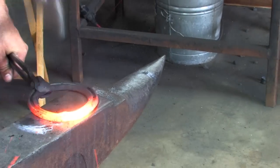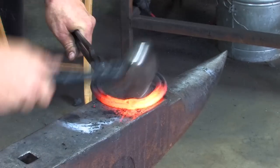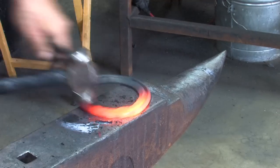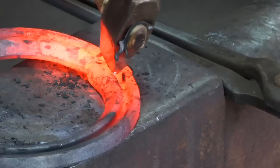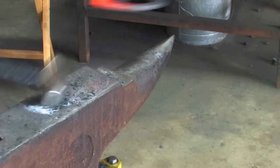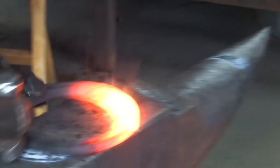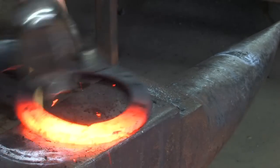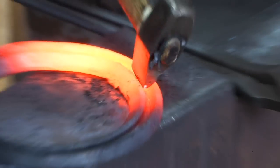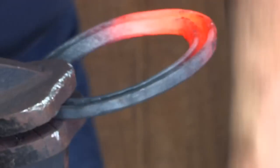All the scarf chipped in — it's a complicated weld right now so I'm going to work all the edges. Shaping the back of the shoe, getting the concave right. I'll start running my fuller through it. Now I can have my last welding heat and my rasping heat. Through with the flat bottom fuller again. Straight to the vise — I'll rasp the whole second half of the shoe.